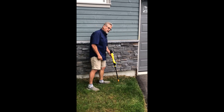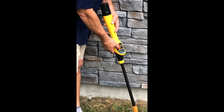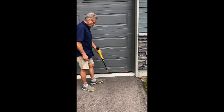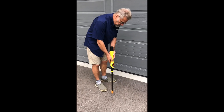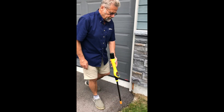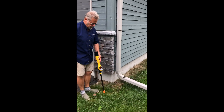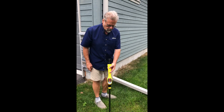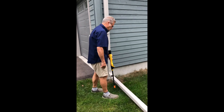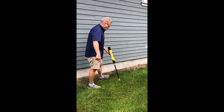Here we are doing a locate. My signal is getting a bit weak as I walk away from the transmitter, so I'm going to turn my gain up just a little bit by pushing the plus button. Now I'm back to a good locate signal and I continue. I'm going to follow it around the corner. We can see clearly that that conductor is exactly right here and going in this direction. Any time you're doing a locate, if you have signal and then lose it, stop and sweep the receiver in two different directions. Whenever you hear signal to one side of you, step over to that signal and follow it. Here we are tracing the gas line that I put my signal on.